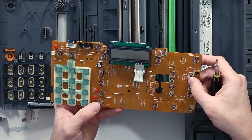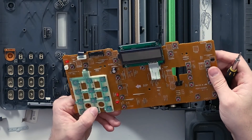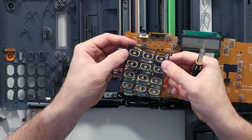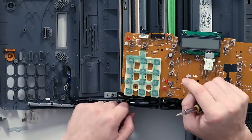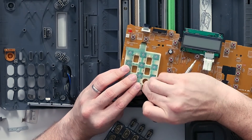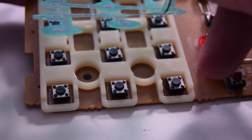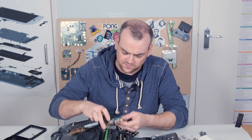Here's our first real look at electronics — or tact switches actually. From the feel of the buttons on the front, with this little mesh and these little spring-loaded arrays, I don't think I would have guessed that these were tact switches. You've also got two layers here of a membrane keyboard — two clear overlay layers, two little contacts which get pressed together as you press the buttons, but they are sat on top of tact switches.